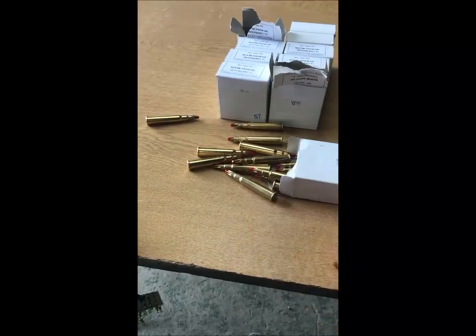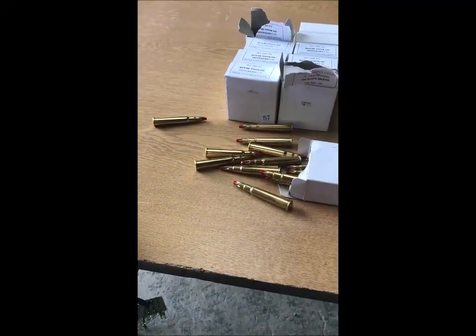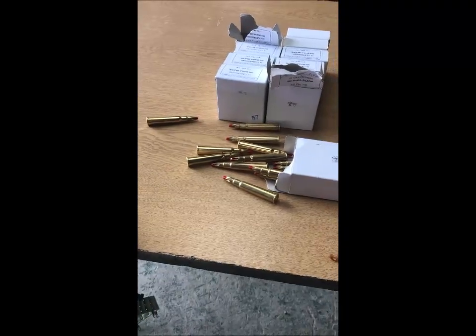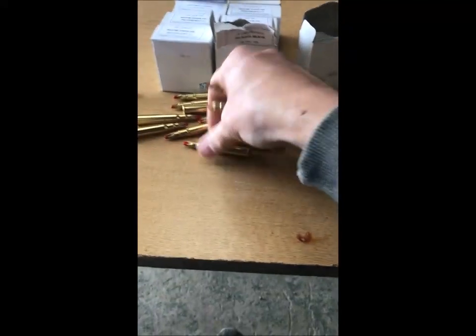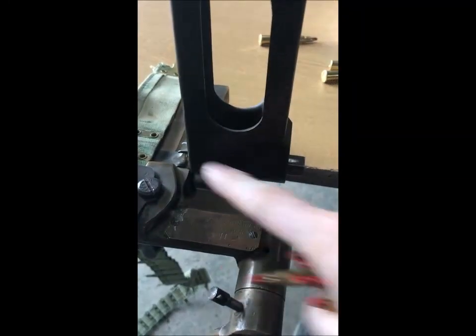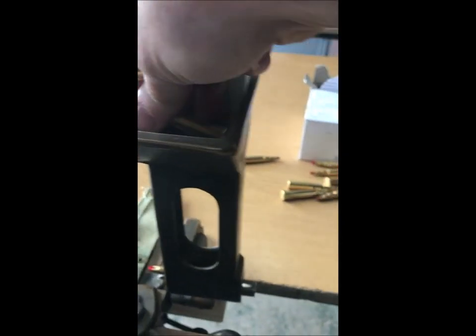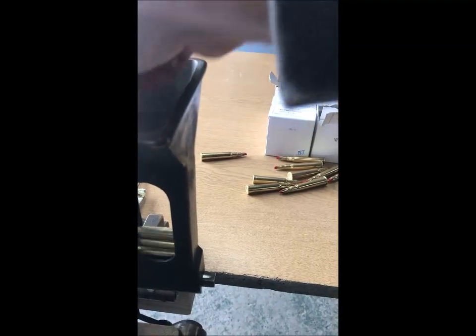Here's my ammunition — it's PPU long-nose .303 blank, a couple of years old, but certainly what I'll be trying to run the gun on today. You can grab a good handful of it — all needs to be in the same direction. Try and make sure that it's across the bottom so it's not landing straight into the breech of the machine. That loads up nicely.